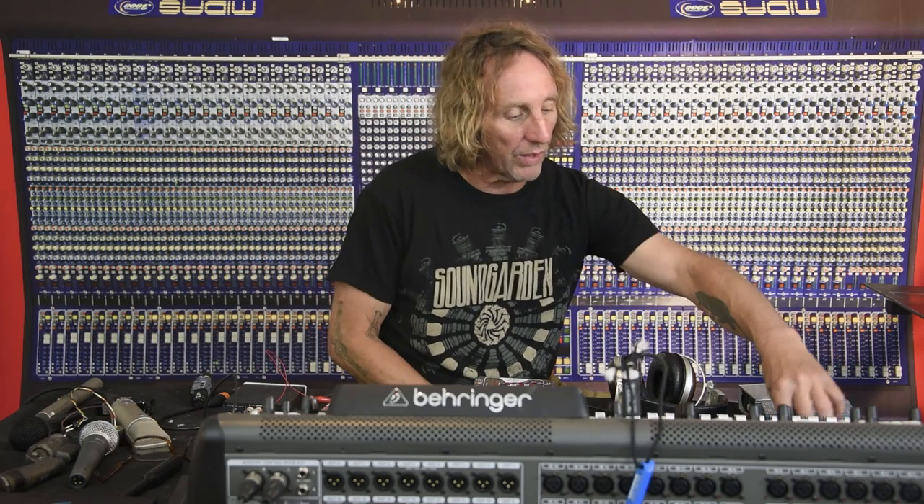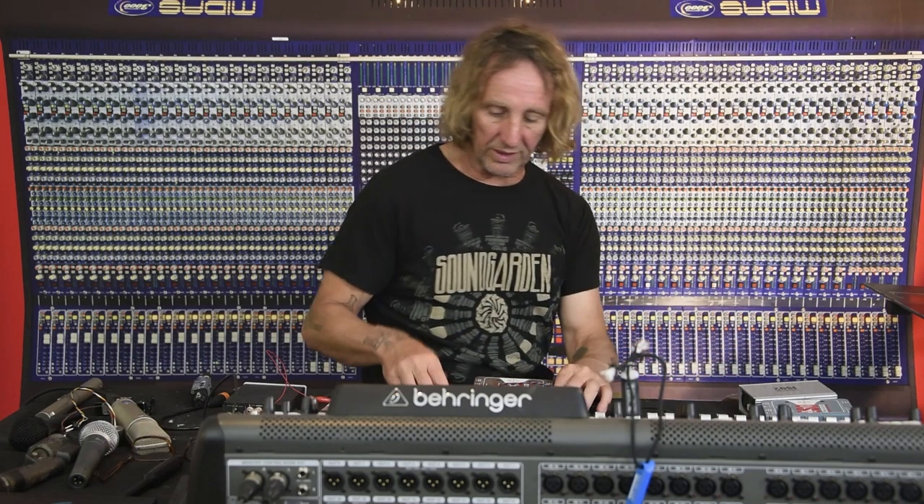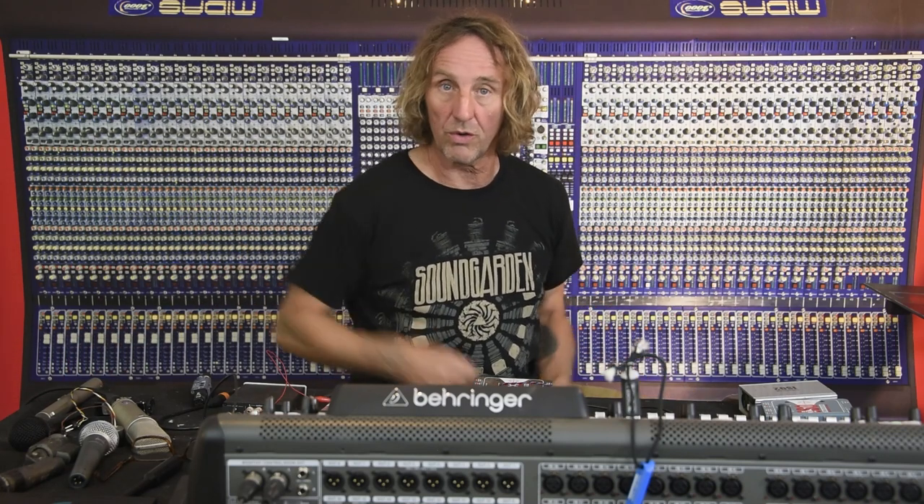I'm Dave Ratt and this is the third video in a series on audio transformers. I've got a speaker set up here underneath some insulation running into a microphone, plugging in various mics. The next one we'll do is a Neumann U89, going into a Y connector — one side into channel one of the console, and the other side where I can plug various transformers in so we can look at the impact on the signal and hear them in the recording on the Tascam recorder.